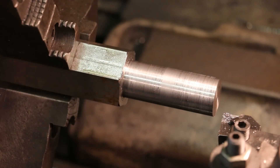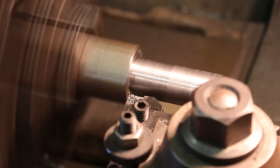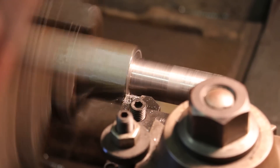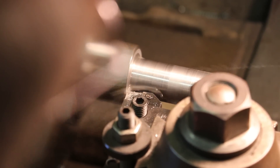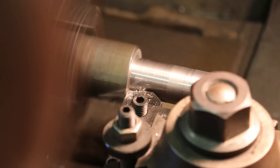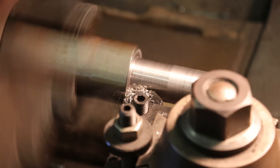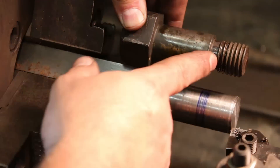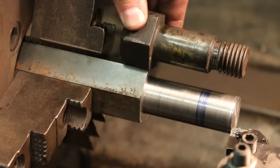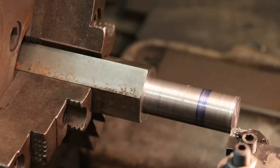I'm going to go ahead and face off the bottom to make sure we've got a good square bottom all the way down. So the new bolt's coming along, and now I'm going to cut this step down here. This is a 1-inch 8th thread, so we need to turn that down to 1 inch. I need 125 thousandths to come off. I've got a hundred thousandths dialed in right now, and I've got a mark on here for how deep I need to go.